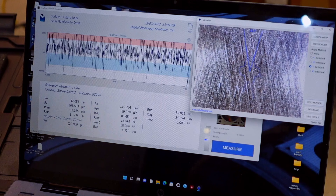We finished the roughing operation — we took about almost two thousandths, one thousandth to clean it up mainly because of the rust. The cylinder was actually straight within three tenths, but we wanted to get rid of that rust. With the microscope we can go in and check and see everything. Right now we have an RZ of 366 — you've got to get your RZ deep enough; otherwise by the time you finish your plateau you will not have a deep enough RVK. You want your valleys to be deep enough. If you started your RZ in the low 100s you'd never get a deep enough RVK by the time you do the final plateau hone. Right now we're at an RVK of 80 with an RZ — peak to valley height — of 366.